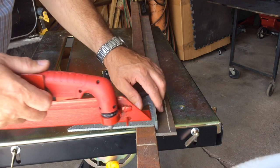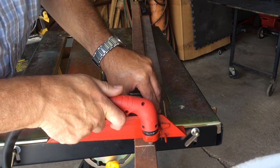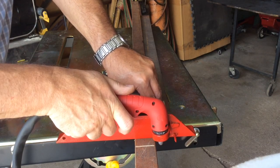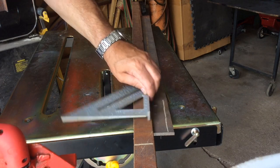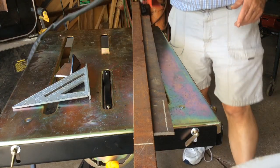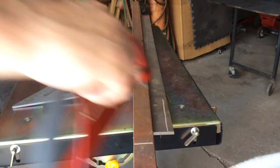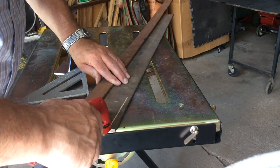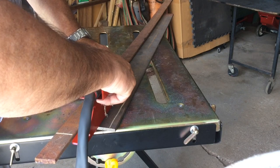I have my piece all lined up. I put my square on there, straight with the edge, so I'm going to get a nice straight cut. I put my guide on there, line up my pointer, and I'm right on the line. I'm hanging on to the guide itself rather than the gun, so I'll just pull the trigger and slide back - it's going to cut a nice straight line. Or if on a longer piece, I would use a long straight edge clamped down as a guide, put my pointer on it, slide the guide forward, and get a nice straight cut.